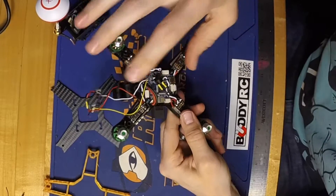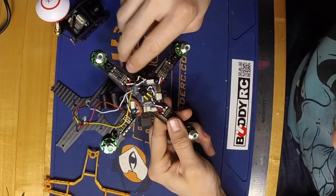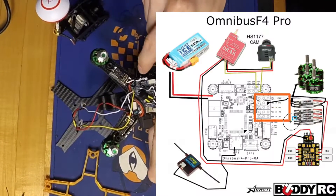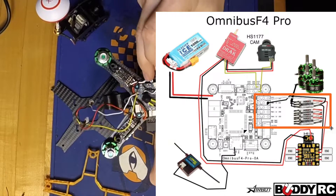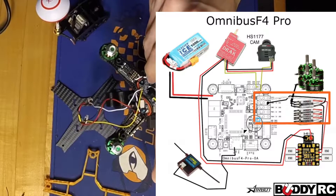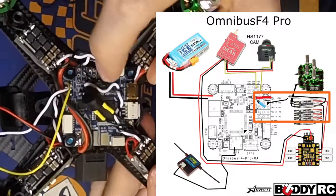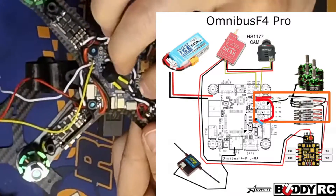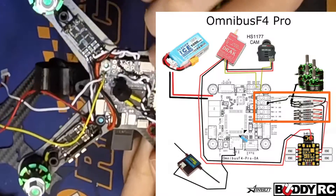After I had the board powered and made sure it was working, I went ahead and took all my ESC signal and ground wires and soldered them to the ports. I'll put up the flight controller pinout and show you exactly how I soldered those up. It is important that they don't start at the very edge — they start offset by one, so I don't end up using the first row, and then it goes one, two, three, four. On some of the older boards I know some people had issues getting the buzzer working, but I was happy when I hooked up the buzzer and it just worked.